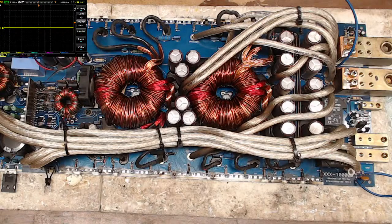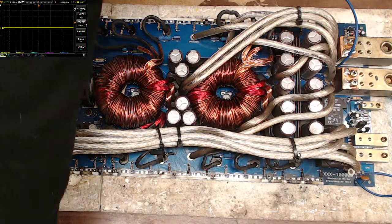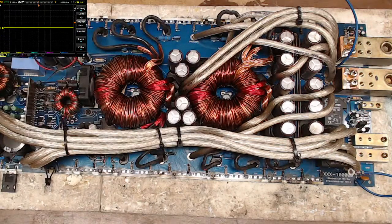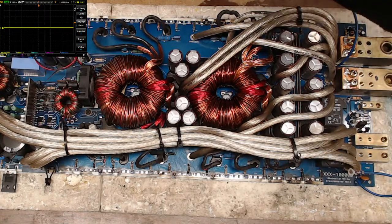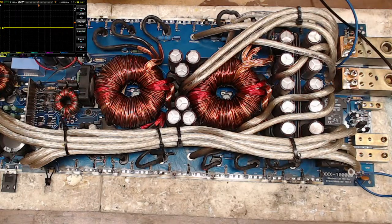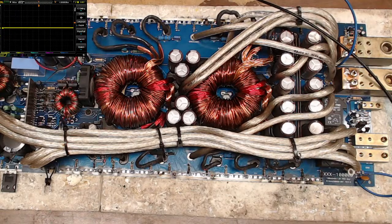So I see no reason. Transistors are out, so it's not going to build any rail voltage. Positive is, I'm assuming, where they labeled positive, and then remote is going to be where they labeled remote. Any shorts? No shorts. The power supply turns to a blue light. I should have 12 volts. I can find my probe. I was so busy yesterday. My poor workbench here is kind of a mess. I should have 12 volts, which I do. And what am I on? I'm in 50 microseconds. So I should be able to power up and get a drive signal.